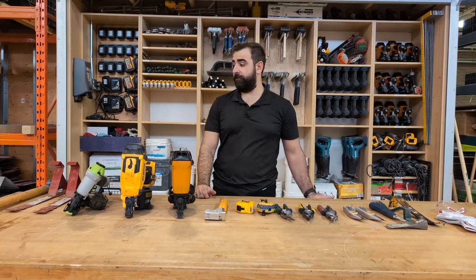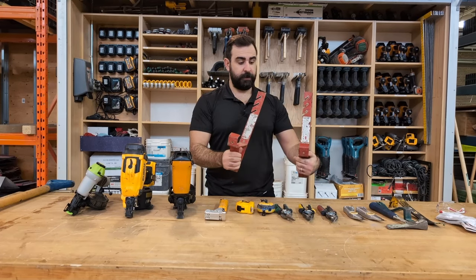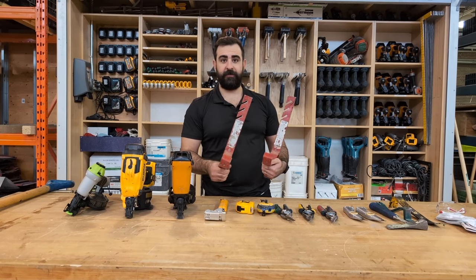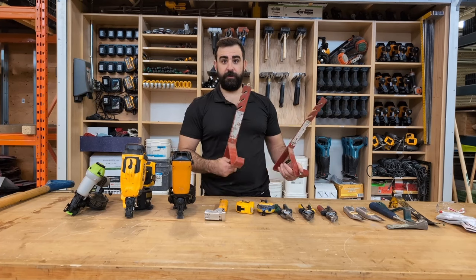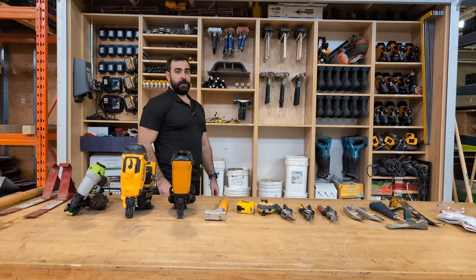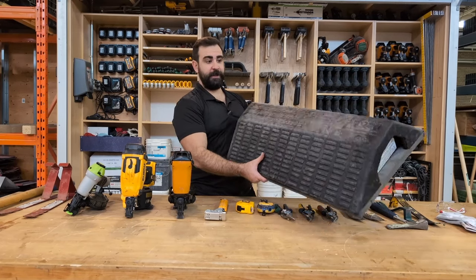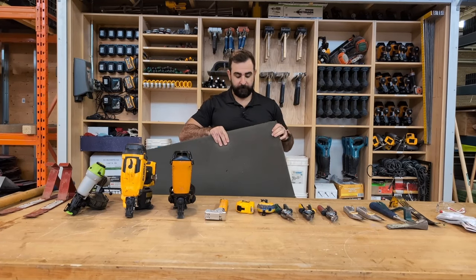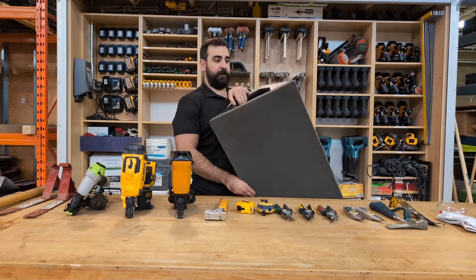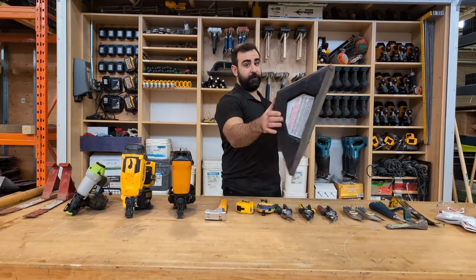A couple other great tools to have in your toolkit. You got your jacks — two of these can be used when setting up on a steeper roof. Set up a board across, a 2x8 or 2x6, to help you climb up the roof and place materials on that board. It helps a lot on steep roofs. Another thing for steep roofs, we got these pitch hoppers. It's a kind of extruded foam piece — very light. They have a little foam on the back so it grips to your asphalt shingles, underlayment, or ice and water. Great for steeper roofs. You can put material on it, stand on it, use it as a platform for tools.